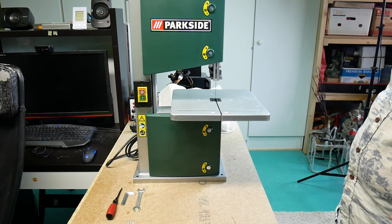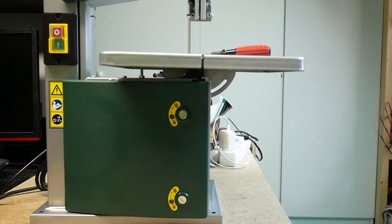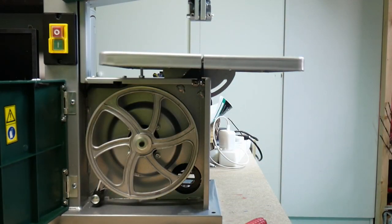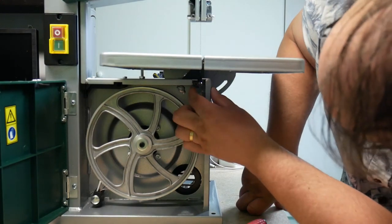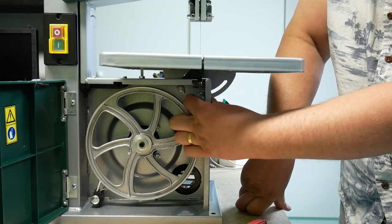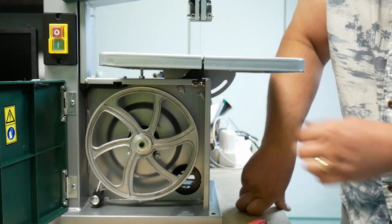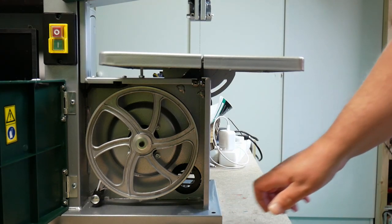And for that I will adjust the camera, I think. So for this part we need to use the screwdriver and then we open the bottom cover, and then they recommend looking at these two guiding rings that are guiding down there, and then here one should try to see if you press on it lightly that it doesn't move more than 1 or 2 millimeters, and that seems to be actually okay. I will say that the tensioning is all right,